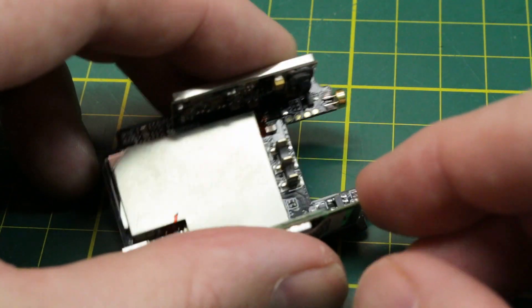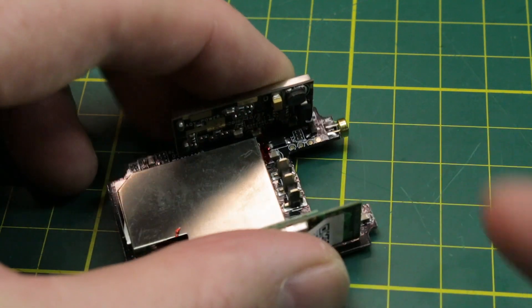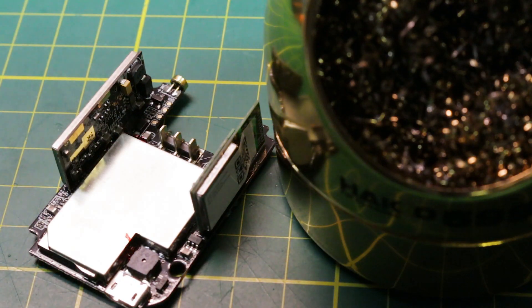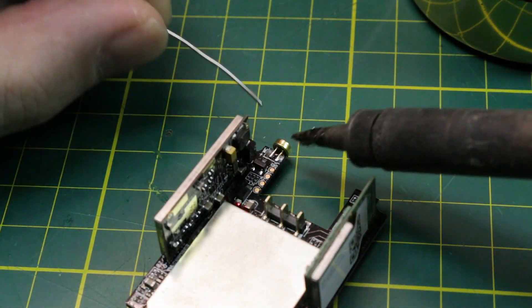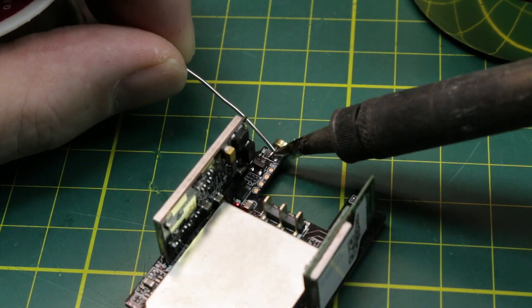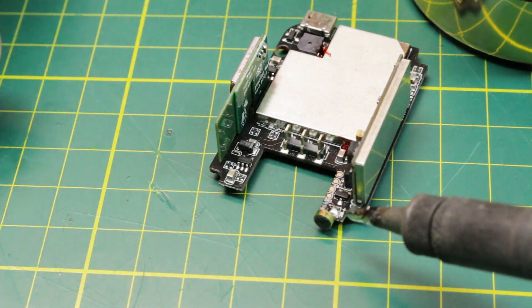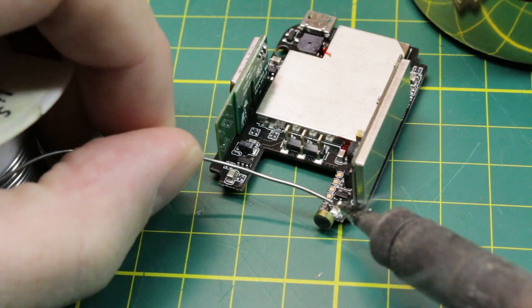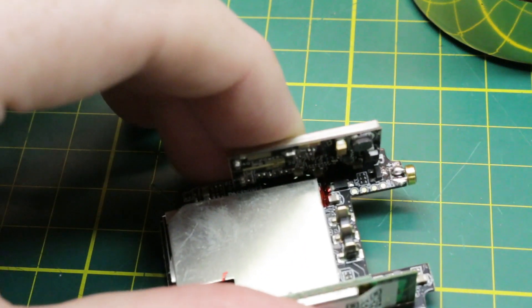What we're going to do is slightly tin the leads just a little bit more with some leaded solder, because this is probably lead-free on there. Clean our iron, tin the tip of our iron. Apologies for my shakiness in advance, but this is small stuff. Be careful you don't bridge the leads, and if you do, no big deal — we can fix that. We just suck it back off with our solder sucker or some wick. There we go — those look good.